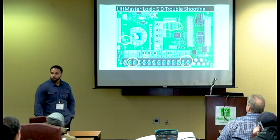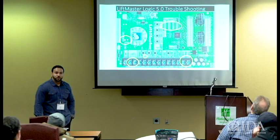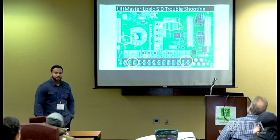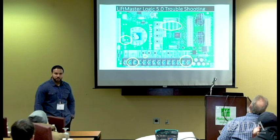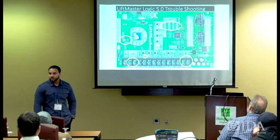Open limit switch. What it means is that the limits are not set properly. You're actually engaging the open and the closed limit switch at the same time. That motor ain't going nowhere. So the limits are not set properly. You can look at the board and see that out the gate, that is making contact with both. Only one should be open, only one light should be on at one time.